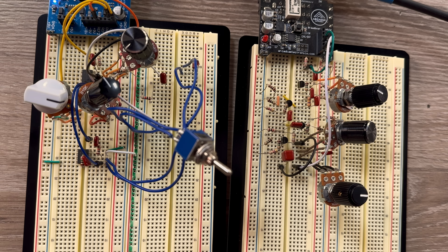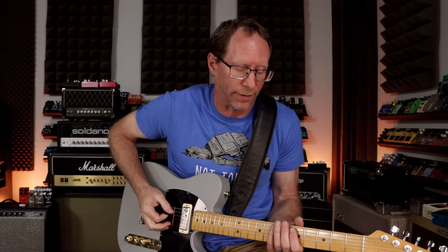Let's go to a completely different type of distortion circuit. This one is using MOSFETs - no op amps whatsoever. I'm pretty much trying to make sure the frequencies are somewhat similar so it's not radically different, using the same type of tone control exactly. The gains aren't perfect but they're pretty closely matched. Now, keep in mind a lot of times with distortion and overdrive circuits, sometimes you hear a YouTube video and think it sounds about the same. A big difference with different types of clipping structures is how does it feel - is it compressing more? Does it feel spongy? Does it feel tight? Does it feel responsive or does it sag just a little bit? And that stuff of course doesn't come across on a YouTube video.